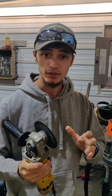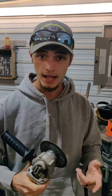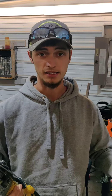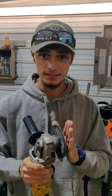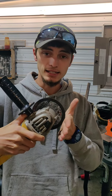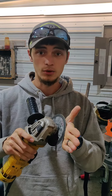When you're using these specifically for cutting as they're intended — and often used for feathering out tacks when you're putting in root passes in pieces of pipe or pieces of plate doing testing and field work — they're intended to go directly into the steel at a 90 degree angle and never lay it back to do any kind of thinning out or smoothing off.